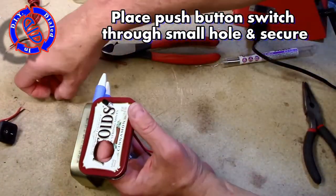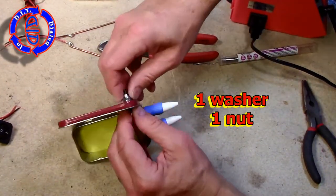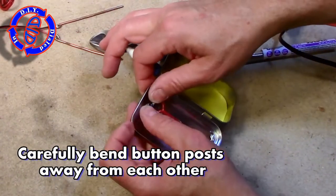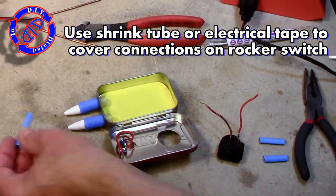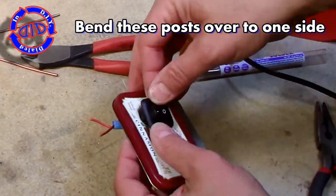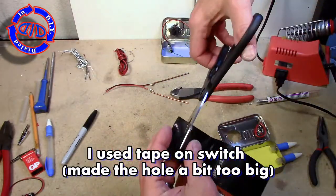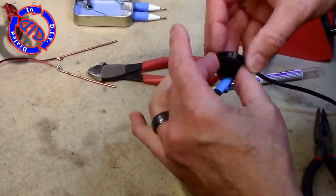On a lot of these projects I like to use salvaged parts; however, both of the switches I'm using today I got a long time ago at Radio Shack. Once I have it secured with the nut that came with it, I turn it back over and bend the posts apart from each other so that when I close the lid everything will clear and there won't be any obstruction to closing it. To further reduce the potential for short circuits I'm covering any exposed post or wire with heat shrink tubing, but you could also use electrical tape. I did find that the hole I drilled for the rocker switch was just a little too big, so I'm grabbing some gorilla tape — or you could use duct tape — and wrapping it around the rocker switch, then putting it back in, and that was enough to keep everything firm.